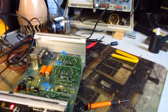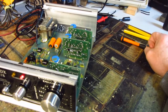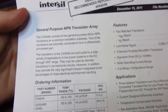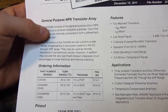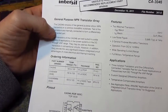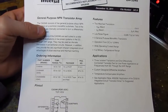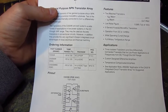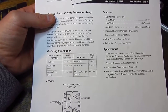So there's a tip: sometimes on one of these packaged ICs you don't have to replace the whole IC if it only contains general-purpose transistors. Here's the datasheet for the CA3046 — it says 'general purpose NPN transistor array.' There's nothing particularly unique about it. Two of the transistors are internally connected to form a differentially connected pair, but the other three are just general NPNs. I used an S8050, but pretty much any general-purpose transistor for 10 cents or less would work fine in this application.